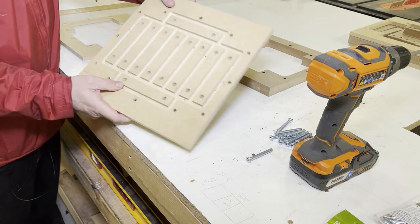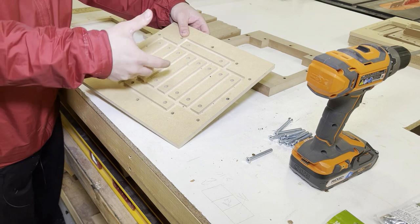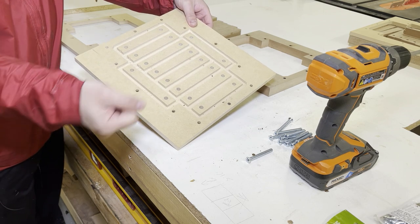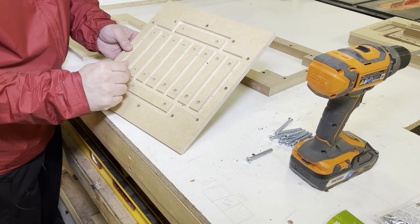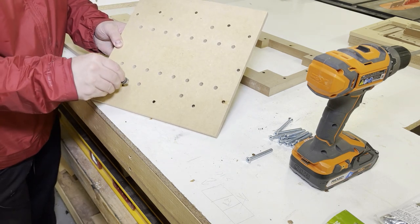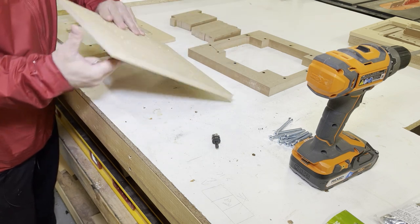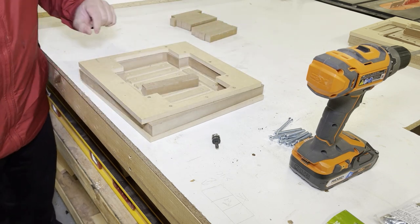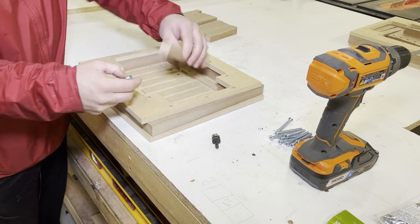Here's the bottom of it. I'm going to ease these edges — that will create a line after we pour the silicone and get the mold out, so I'll know when to stop pouring and I'll have enough room that it won't spill. I'll get a Dremel tool and do that. I'll coat all of this with paste wax so the silicone won't stick and it'll be protected. I'll countersink every one of these holes so the bolts fit flush. It's a three-level system — the inserts screw in, the top fits in, and it bolts from underneath.